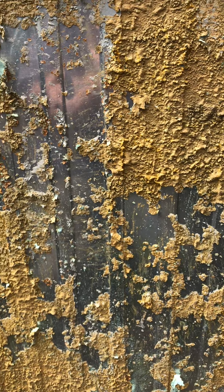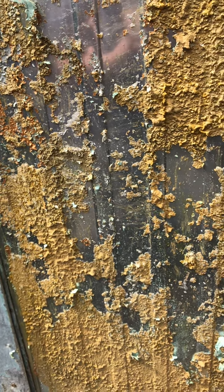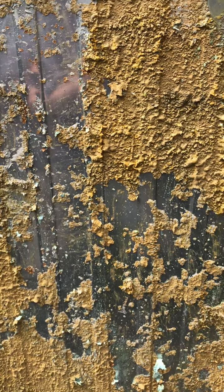I think it could be pretty much done with two really thick coats. As you can see it's got it right down to bare metal in places. It can then be washed off with soapy water to dissolve the paint stripper — it's water washable, which is quite key, because otherwise you'd have to use solvents and that's very expensive on top of the price of the stripper. I hope this helps — any questions, pop them in the comments below. Thank you, bye!